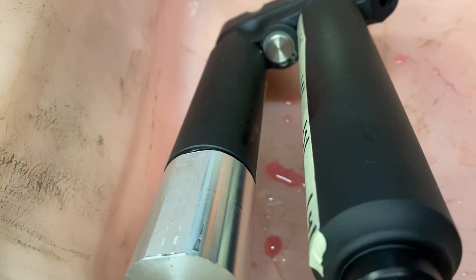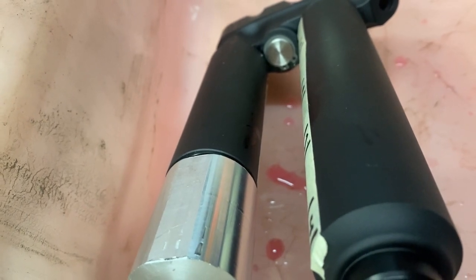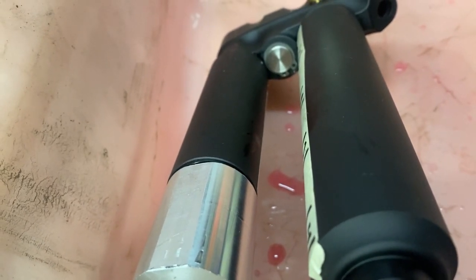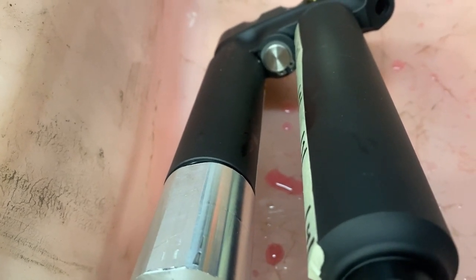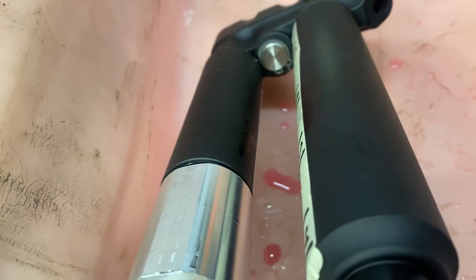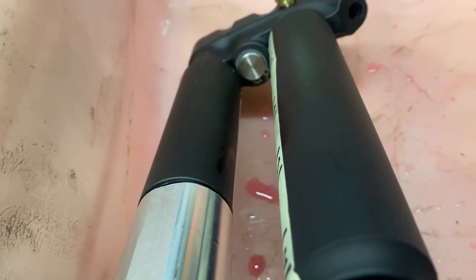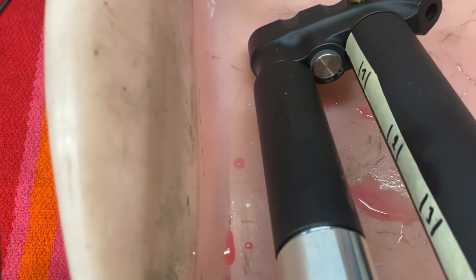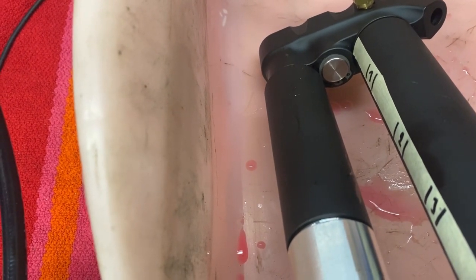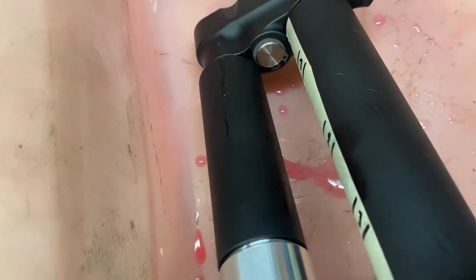Need to take it apart, take proper measurements, and then we're going to conclude these findings. I was thinking about, should I push it to 500 or not, but it was already at 460, 470-ish for some time before it started dropping, but it was at 450 for a good 10 minutes. Didn't yield. Interesting. The possibility is either there's a change in heat treatment of that material, because the material is probably the same. I'm going to test that material when I get a chance.